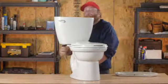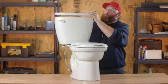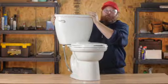After that's done we'll go ahead and hook back up our supply line, then you'll turn on your fill line. Go ahead and carefully put the back of the tank back into place. It's a great idea to go ahead and replace this any time you have to replace your mounting bolts, and it's a lot easier than going ahead and replacing the whole toilet. Thank you all for watching and good luck with this project.